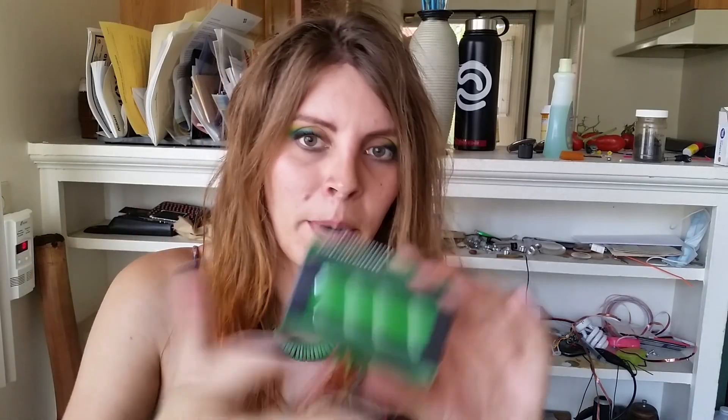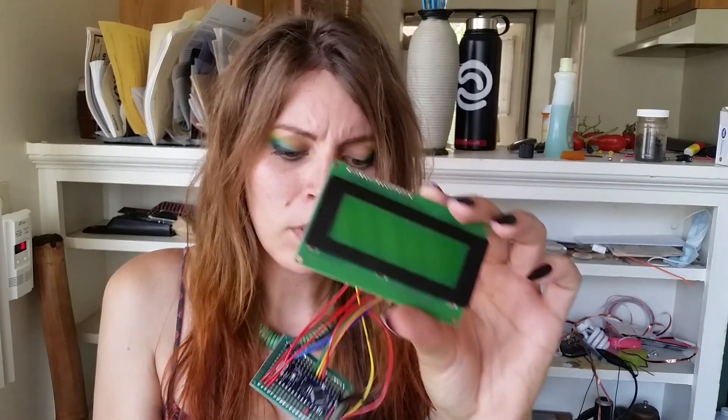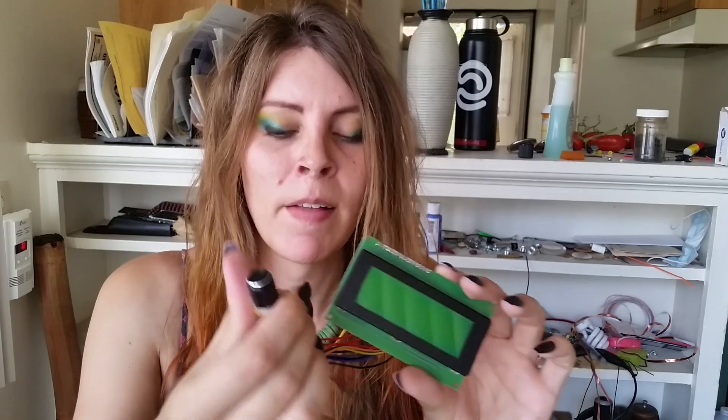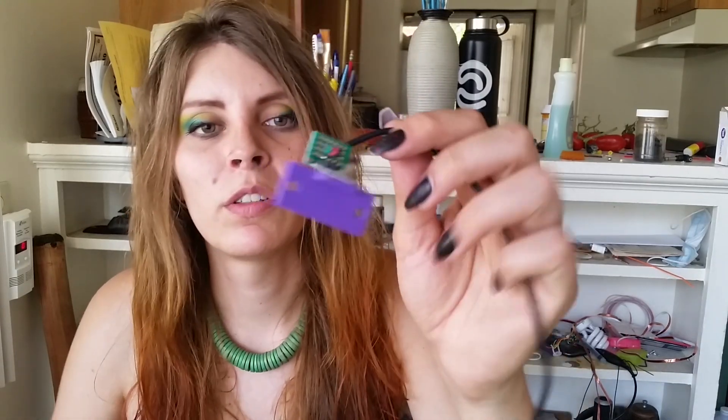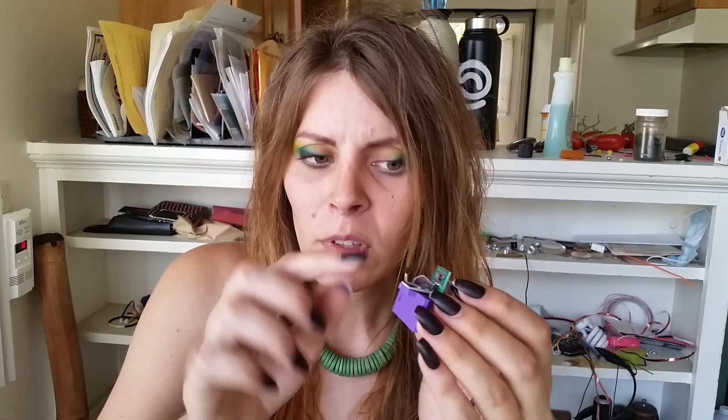So I have my LCD, my Arduino, and a potentiometer for adjusting the contrast of the screen. The sensor is the heart of what makes this work — it's a Hall effect sensor. I glued six magnets around the rim of the top wheel of the bandsaw, and the Hall effect sensor acts like a switch: every time one of the magnets passes by, it sends a signal to the Arduino. The sketch, written with help from my friend Roger, works kind of like a stopwatch.